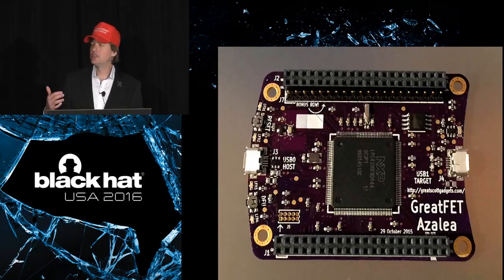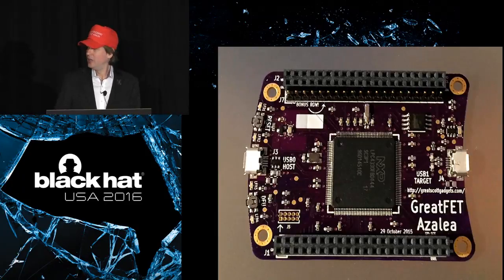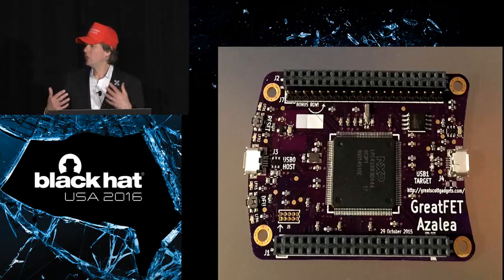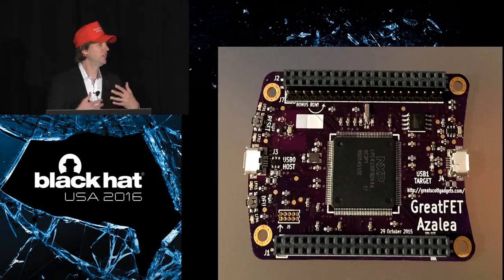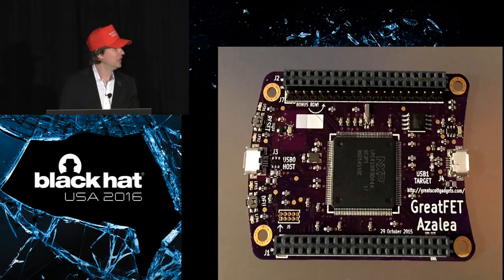And this is a feature, there was a similar feature in the microcontroller that was in GoodFET. And that was a feature that I really appreciated as a user of GoodFET, especially when I built my own board. It was the first board I built. I soldered it all together, I plugged it into a USB host and crossed my fingers, and when there wasn't any smoke, I was able to load firmware onto it without having to have another hardware programmer to load that initial firmware. So it solved the chicken and the egg problem that a lot of electronics hobbyists have, where they have to like buy a programmer just to program the board that they built. GoodFET can be your first board that you build, and you can bootstrap it by itself, and then you can use it to help you build other things. And so this was a very important feature that I was excited about having in a replacement board.